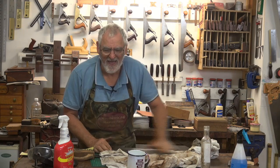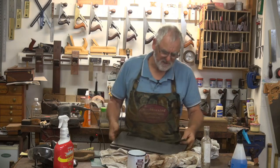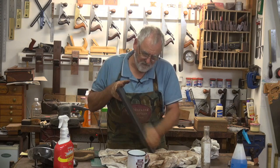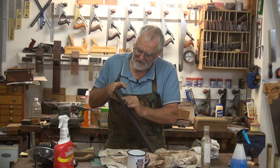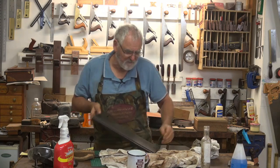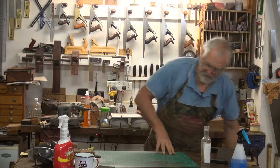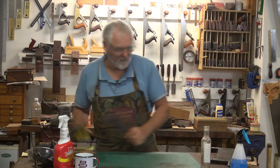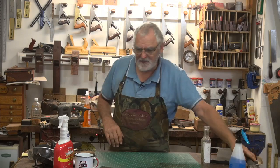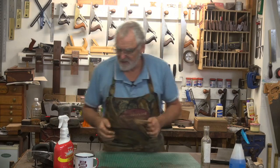Yeah, no, oil can be a pain because it can leach into your timber. But don't forget, and I know I stress this a lot, all these machines are not meant, underline the word meant, to be finishing machines. Whether it's a saw or a sander or a router, a bandsaw, anything, their primary job is to reduce or remove waste. The actual finishing gets done, well, in my shop anyway, by hand, where you've got more control over what you're doing. I've found oil's a pain, but if I use a WD-40, 3-in-1, Inox, RP7, one of those styles, and let it dry, and then wipe off the excess, it's not too bad.